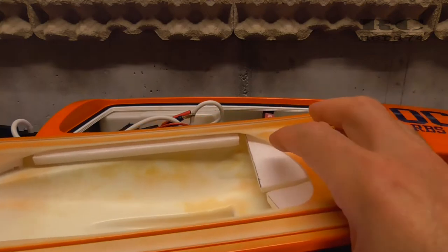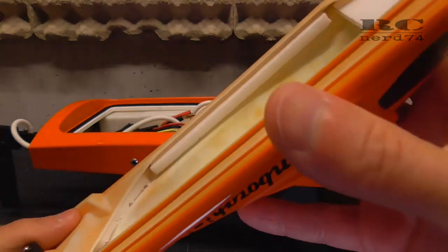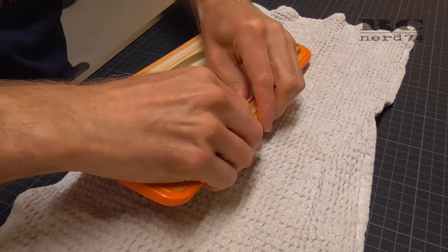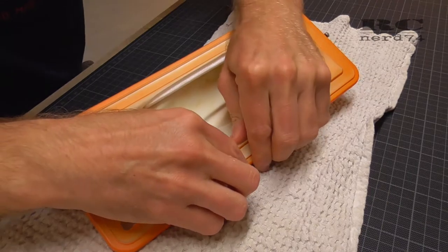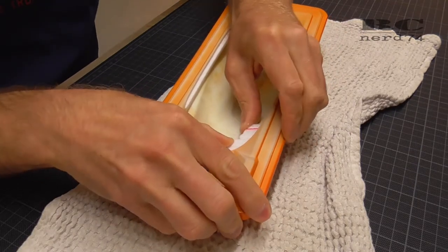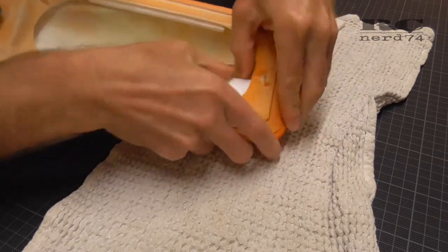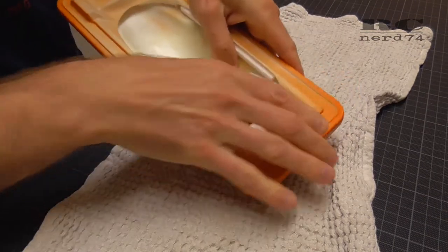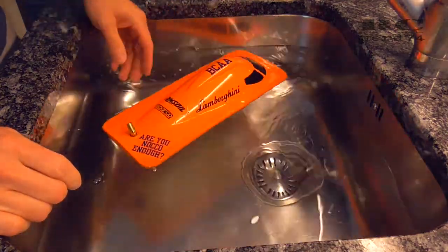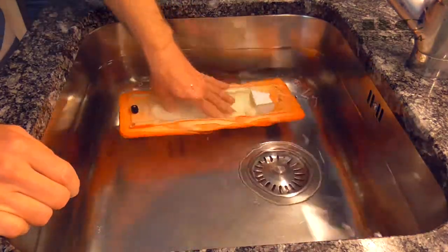What I did is that I took some 6mm Depron and cut it into the right shapes to make it possible to push the different parts all around into the hatch, to get enough foam in the hatch to make it unsinkable again. It was trial and error how much foam it needs, and the amount of foam you can see now here works pretty well to keep the hatch unsinkable. I also tried it in my kitchen and it worked pretty well, so I'm sure now that I won't lose my hatch if I have a crash which takes off the hatch from the hull.